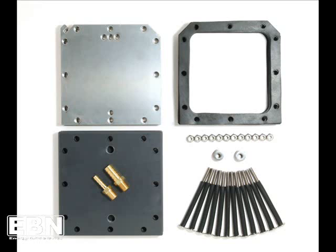Also in the kit should be a pair of pre-drilled, pre-tapped PVC end plates, along with screw-in hose barbed fittings. The barbed fittings are made of brass. The plates are made of 20-gauge, 316L-grade stainless steel. Your gaskets are made of a 70-durometer, 1/16-inch thick neoprene material. The little sleeves that go over your bolts are made of PVC, and the various hardware pieces are made of stainless steel.